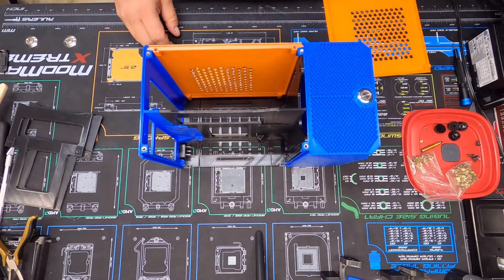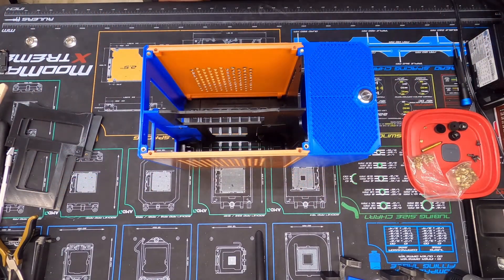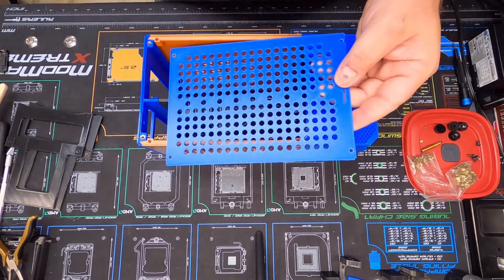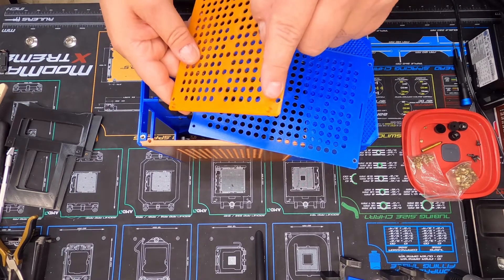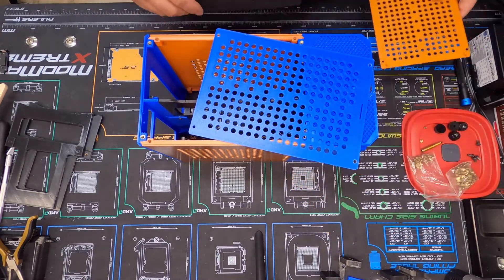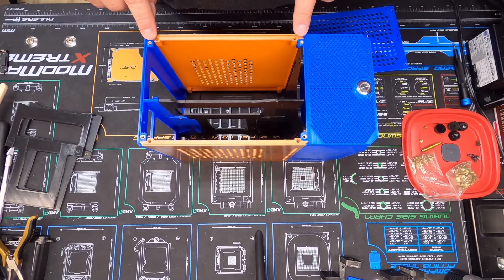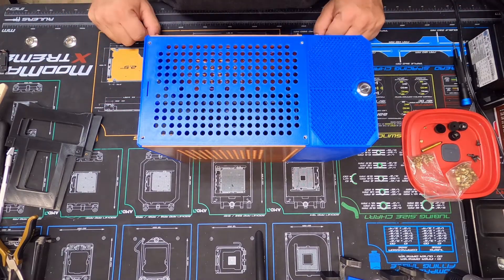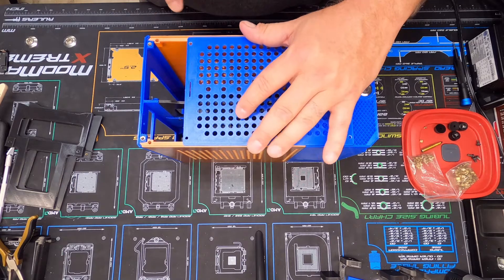What they don't show you in the print is the top plate. The top plate typically comes with these little nubs printed on right here. I don't like the nubs - I let it print so I have a center point, and then I drill those nubs off entirely. Those nubs slide into where the brass inserts are on top of the case. The intention was that the top plate just sits on there and floats, with the little nubs keeping it locked into place. Personally, I put brass inserts, drill the nub out, and I'll drill these holes right here when I get the side panels done. I'll put a screw there so there'll be two screws right here in the corner.